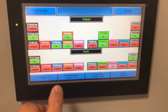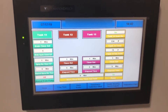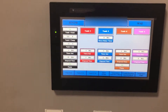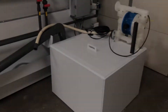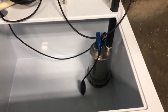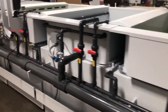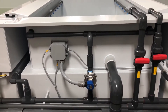The buttons on the front of each tank will blink when the system is ready to index parts to the next tank. All of this is fully programmable and customizable by the customer. The system also features a wastewater pump to pump wastewater and possibly treat it in the customer-supplied wastewater treatment system. All drains are tied together in one large plenum to dump into this tank via gravity feed.